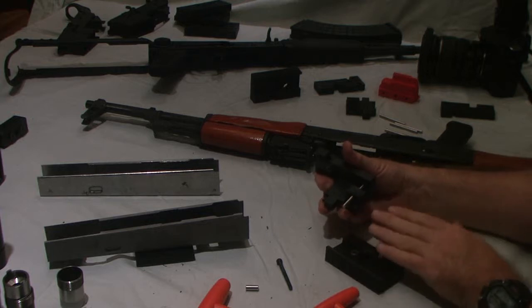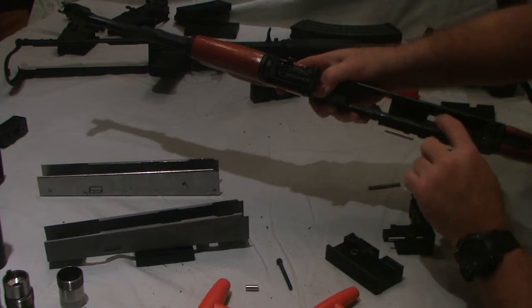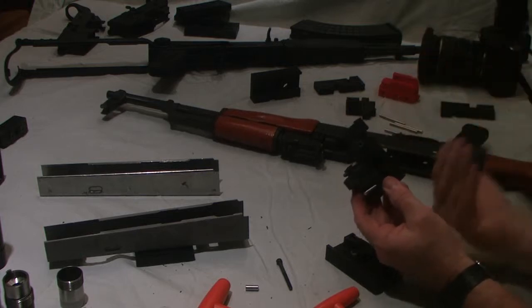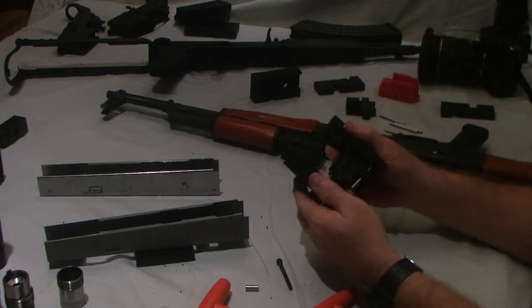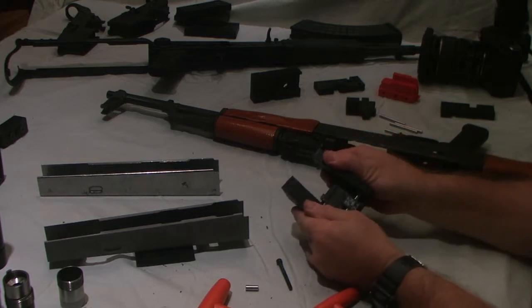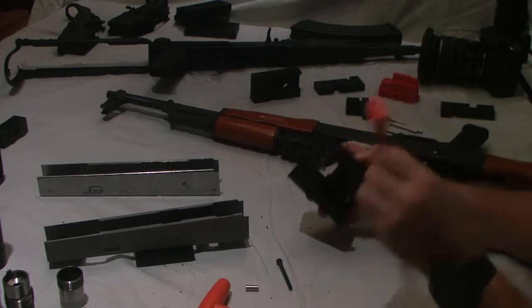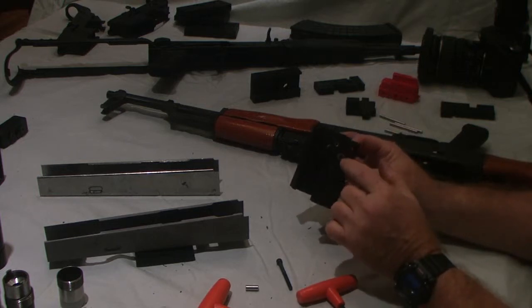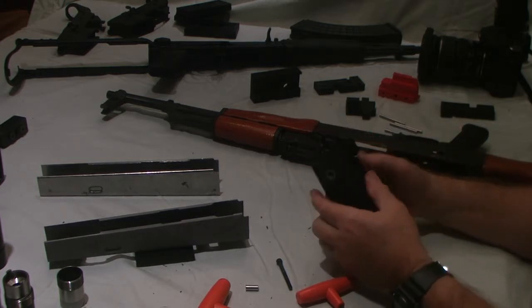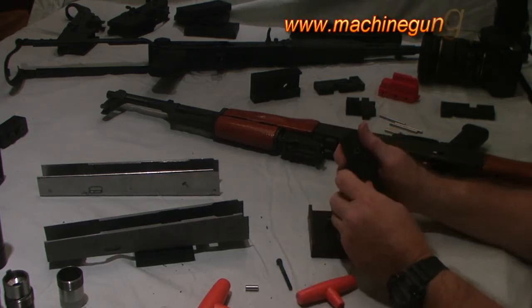This is what holds it up into the trigger opening — you should be able to see right back here. This reaches up through the opening, and that pin, when it comes across, captures it and pulls it up so it cannot move. Then you put your second plate to the side — the square key goes into the slot, the hole lines up just like that, and this Allen head goes down and grips the nut on that side. So: 5mm hole, your 1/8-inch for your detent, 7mm on this side, and it is relieved for the scope mount. I had a guy ask specifically for that — this should take care of that for him.